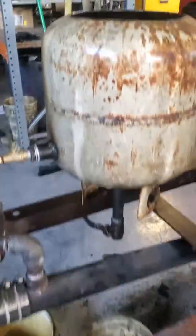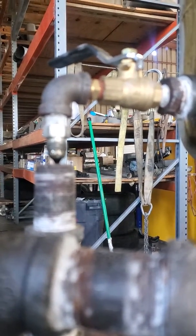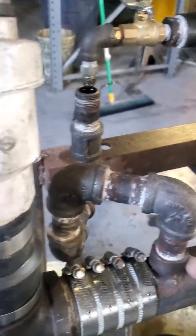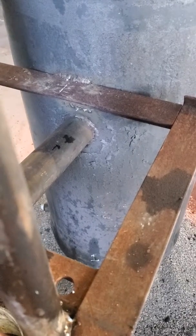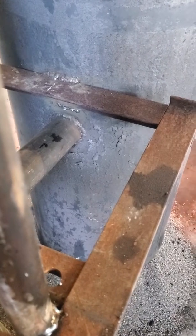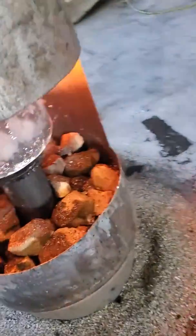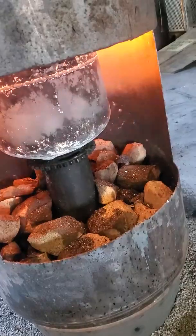Here's the principle: there's a tank for the oil, then a drip tube — you can see how much is dripping in there right now. It drips into this tube, goes down into the chamber, which goes down into the tank and then to a plate with a little 90-degree bend at the end. Then there's a burn plate about four inches round with a two-inch gap. That burn plate sits inside the burn bowl, down about an inch, and that gives you a turbo effect.